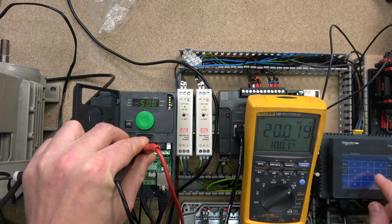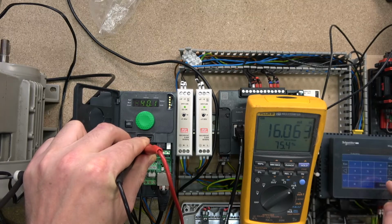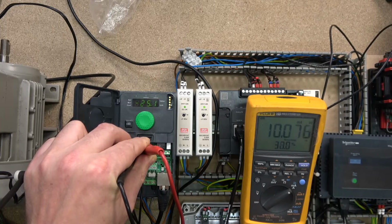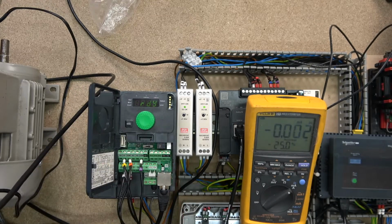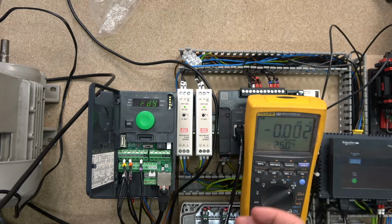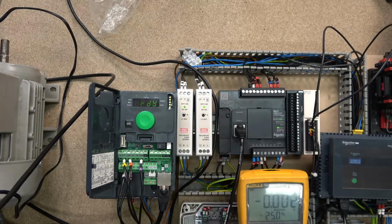So let's say if it's going to be 40 frequency, it's going to be 16 milliamps. If it's going to be 25, it's going to be 10 milliamps. So that's pretty much it. Hopefully you are getting the gist. So this is very good. In the next video we're going to be playing with analog outputs and analog inputs for this PLC. I'll show you where I'm going to be using that.